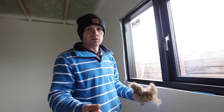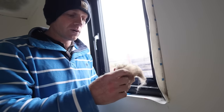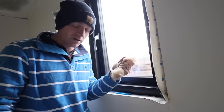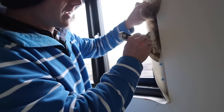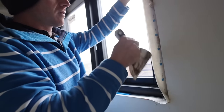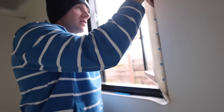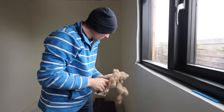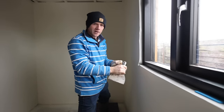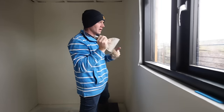That option is sheep's wool, or any soft insulation. There is a product made by Sheep's Wool Insulation which is like an insulating rope - all it is is the sheep's wool twisted into a sort of soft rope. But we've got so much of this lying around as offcuts on the floor that I've just been going along and using it up. The nice thing is I can tell when I've fully filled it - I can push it all the way through until I feel it hitting the tape on the outside, so I know there is no big air gap in there. What that means is instead of using an expanding foam where you're basically trusting that it's going to expand where you want it to.